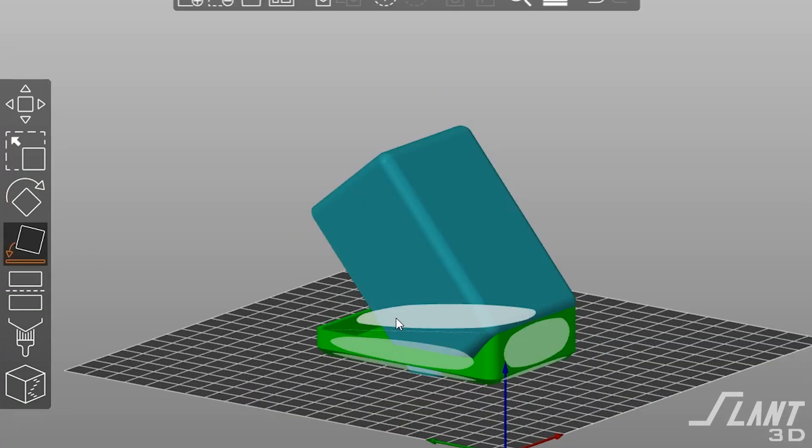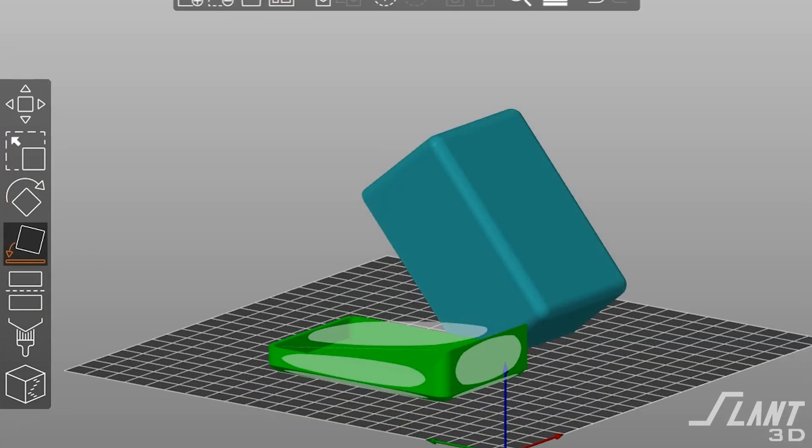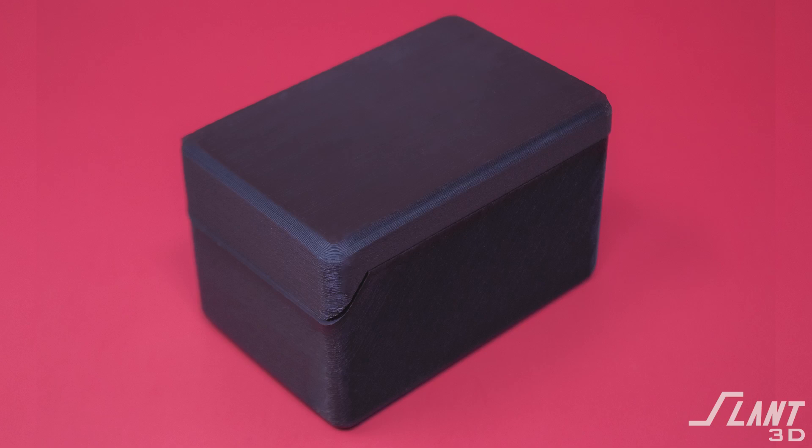The lid is printed flat, which gives it better strength — or you could figure out a way to print it diagonally as well. There's also a little lock-in feature that can be handy. This also leaves the top surface of the lid available to take on any sort of text or markings, or simply remain distinct from the rest of the part. That change in texture can serve as a notifying feature to help the user understand which side is actually the top.